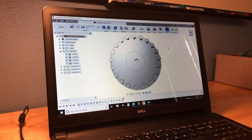So when the gear isn't moving, you can see that each of these pins is touching one of the lobes. Because of this, if a cycloidal drive is designed perfectly, there will be no backlash in the system. These points of contact will prevent it from shifting or rotating slightly. So if designed correctly, a cycloidal drive is a zero backlash system.